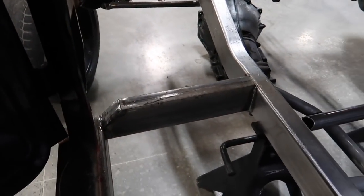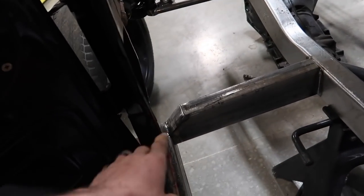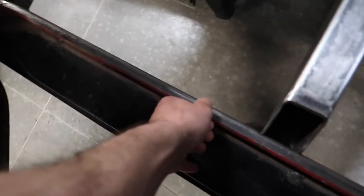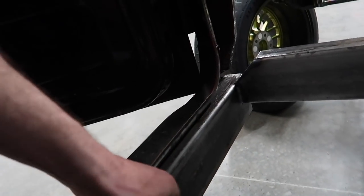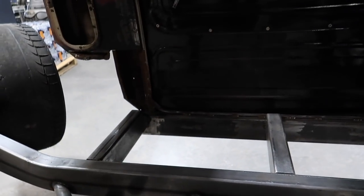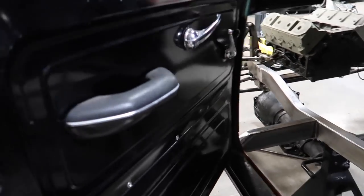We basically ran stringers from the factory frame all the way to the cab itself, with one piece going all the way down the bottom of the door. It was so flimsy and rusted out — we cut out what we had to, but now there's a two-by-four rail in there actually connected to this part, which is completely going to strengthen up the cab. We did it to that side as well, so now this is basically one unit. Thank you guys for watching — this has been a fun episode with my pop. We have much more progress to do on this, especially since we just cut that much out. Have a blessed day, comment what you liked, and we'll see you next time.